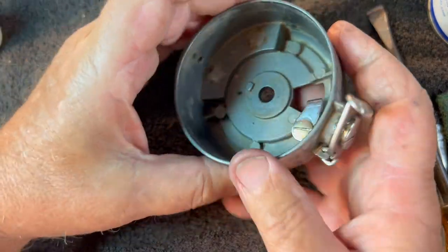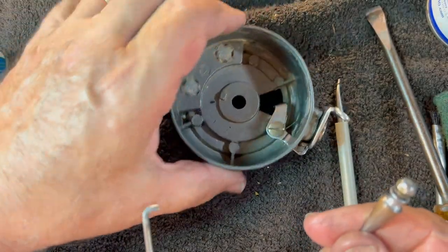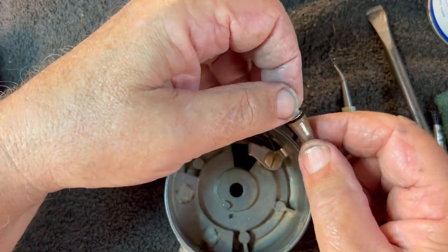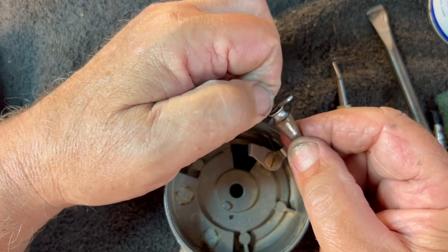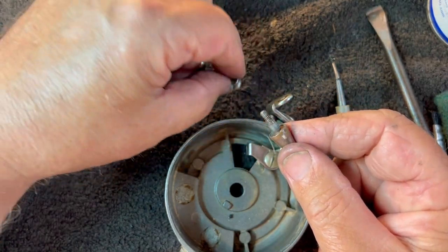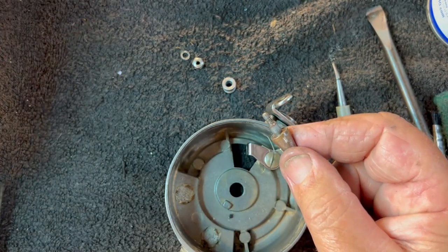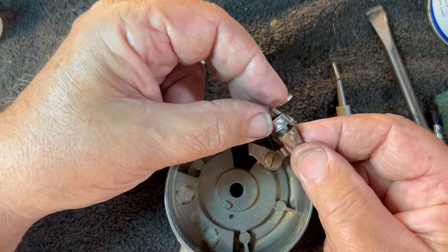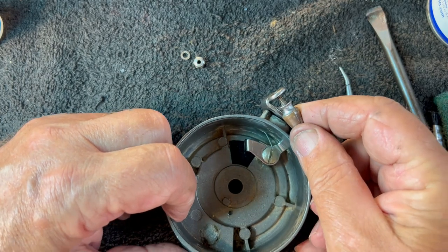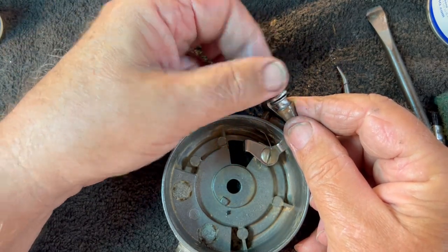The next part going in has got its tag end sticking up — that has to go into this hole right here. It's got to go in like that, then come up and over all of this but still manage to stay in the hole of the spring. We're going to flip this little lever out of the way and get this to drop down, get that hole to line up right there, and go ahead and get a screw started. We've got to get it to sit on the shoulder of the screw. There it is — there's the trip lever. Wow, it's got a lot of force — you do not want to get your finger in the way of that one. Put some oil here, and more oil here on the back side. We're going to put oil under the head of this screw and a little bit right here so it comes in on the bottom of the lever — the lever has got lubrication. Keep your finger out of the way of it.